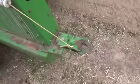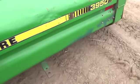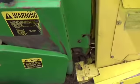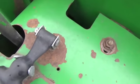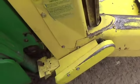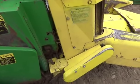It's got the quick hitch on the back, and it's got a new blower band on it I see. I have to look at it more to see how worn down the knives are - they don't look bad, but it's hard to tell without actually adjusting the shear bar and stuff. But the stone looks fairly decent; there's over half the stone left.